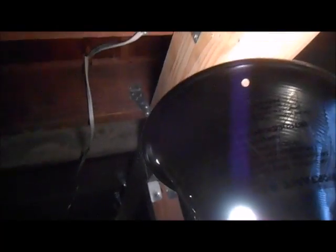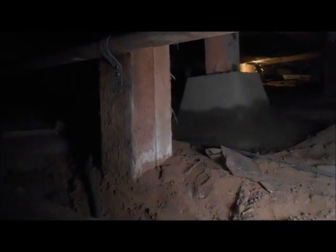That's another issue, folks. I don't like that. Let me try to get in here and show you a couple other ones. And you can see all the metal hurricane clips all nailed all the way. Every joist is nailed. We have another 4x6 beam here. And you can see the post spacing, well, we like to do it. All clipped and nailed. And then we have a third row of beams, folks, way over there.